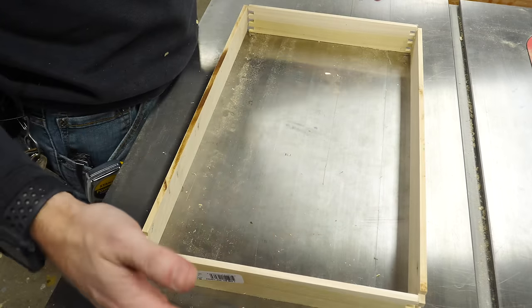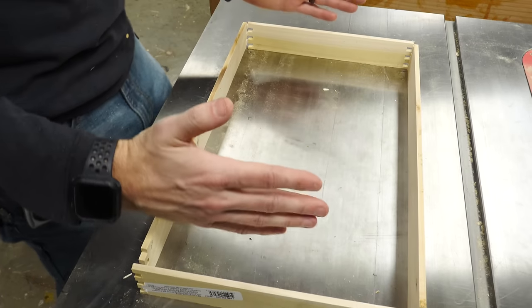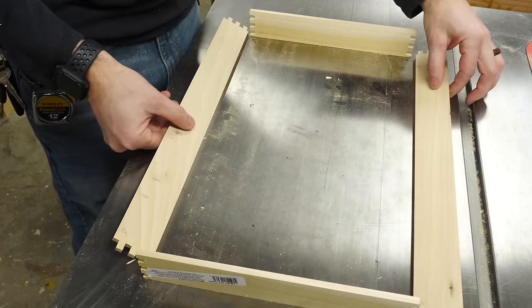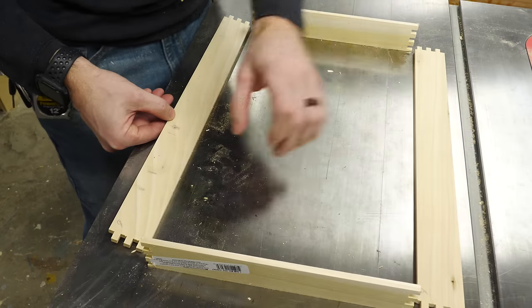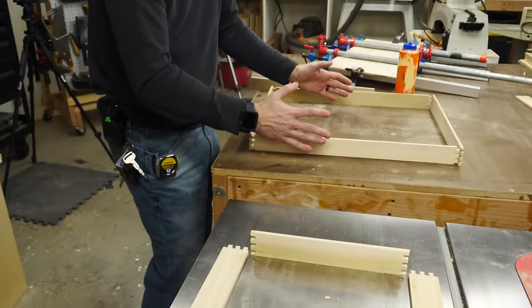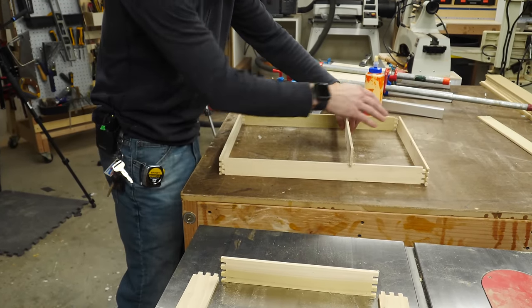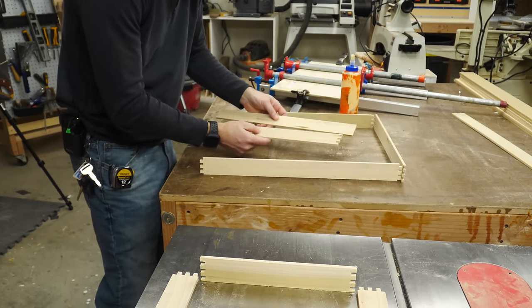I've got these ready to go together in the box, but before I glue them up, I need to cut some more slots in the top and the bottom piece. This is going to be the daily use tray, so I need a bunch of different sections that run down here for normal stuff we use every single day. I'm going to take the top and bottom piece and run them over the dado stack again to put a small dado subdividing all the way across so we can put in some pieces to connect the top and the bottom. On the bigger bottom tray, we'll put a divider so we can have a big open section and some adjustable dividers on one side.